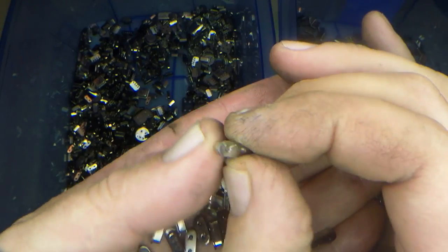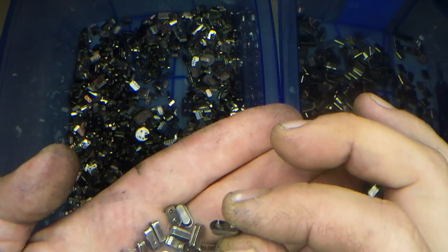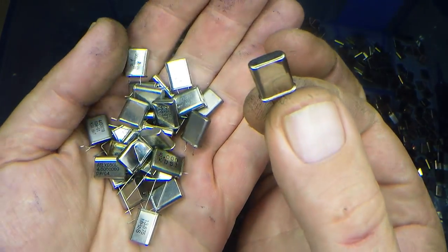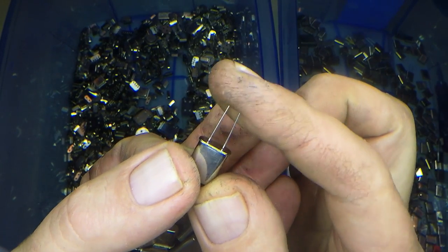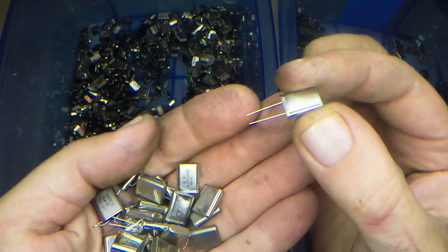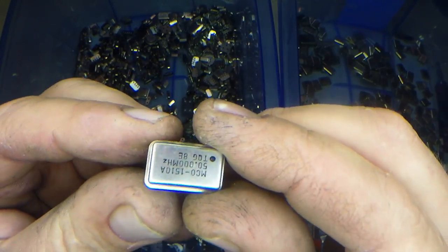As you can see, they've got pins only on two sides — just two pins to a crystal. And the same with these long ones — the upright ones have got two pins. That's a crystal. As you can see, this one here is unused, so it's got the long pins that are yet to go into the circuit board. So that's the difference: two pins is a crystal, four pins is a crystal oscillator.